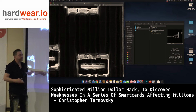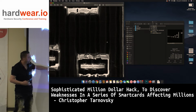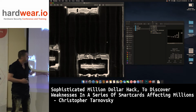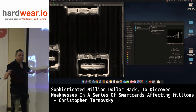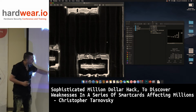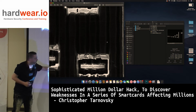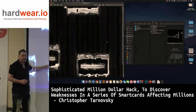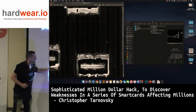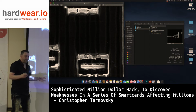This hole is like 5 microns long, if anybody knows microns. I usually probe like a 5 micron window, 3 microns, it depends. The bigger the hole, the longer it takes. So then I removed the shield lines, each one. Then I had a perfect plate of metal here. It lit up white. It was perfectly white. And then I used a high beam current and I removed the metal everywhere. And then now it got black again because the metal's gone.